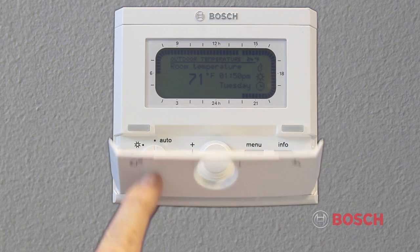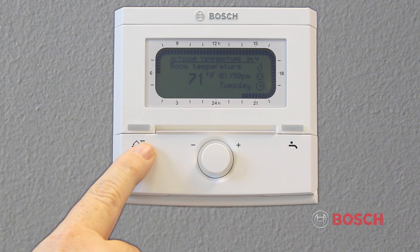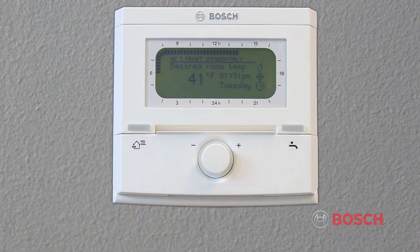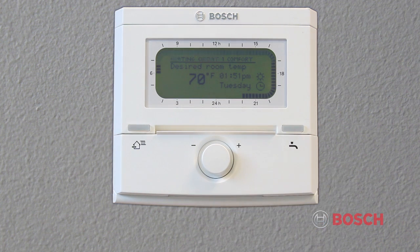On the front of the FW200, you'll see an LCD screen and 3 buttons. The button on the left is the coming or leaving button. This starts the next operating mode, such as comfort, economy, or frost, of the heating program immediately. The heating program is thus changed temporarily. The button on the right is the domestic hot water single charge button. This button starts the hot water heating immediately. The domestic hot water program is thus changed temporarily. With the hot water button pressed, this will give an hour of heating to the hot water storage tank or 30 minutes of preheat to a combi boiler.